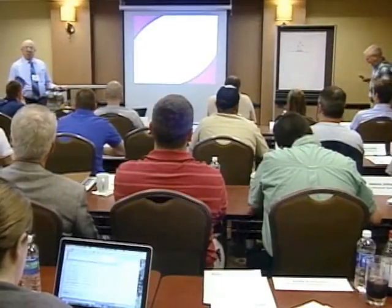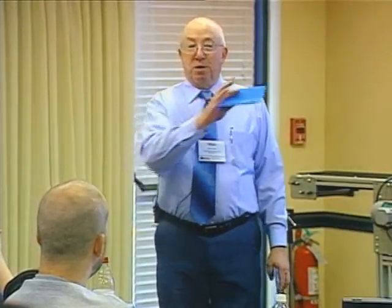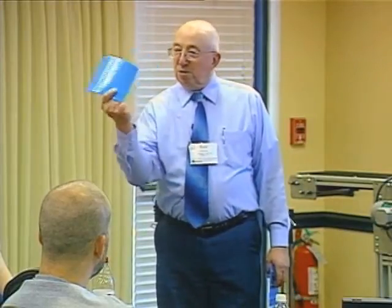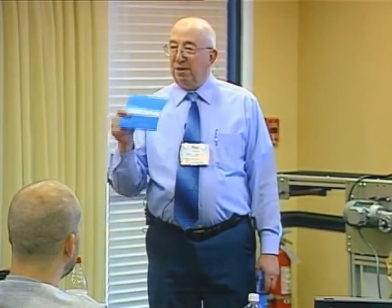You can also perforate. Now we're going to give you a word of caution on perforating. Yesterday when we talked about perforations on belts with fabric reinforcement, we said it's going to reduce the load capacity and weaken the belt. When you take something that has no fabric in it and start putting holes in it, you've got to be very, very cautious as to what your hole patterns are and how much open area you end up putting in. So generally, in most cases it's going to be the type with the fabric reinforcement, or one with the positive drive option.